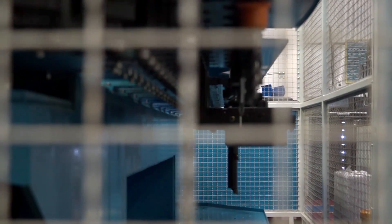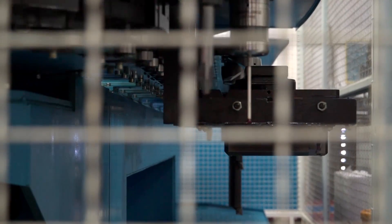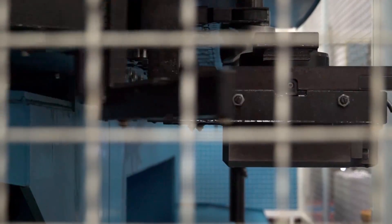These Deandrea heads — how many have you got and what are the differences between them? With the Deandrea heads, on one of the products we produce a couple of different features in the sides of the product — one set up to produce a bore, one set up to produce a ring-type joint which is common in oil and gas. Do you find that with this level of tooling you don't have to change tools very often — you've pretty much got a full suite of capability here? Yeah, that's correct. When we purchase the machine we go through quite a long study in order to procure enough tooling to allow the operator to keep the machine in cycle as much as possible.